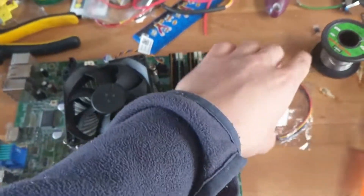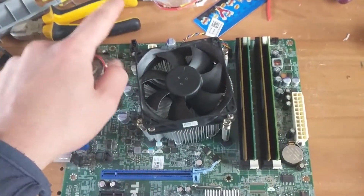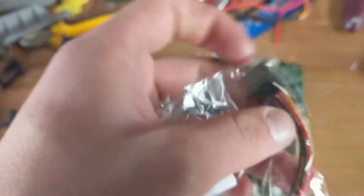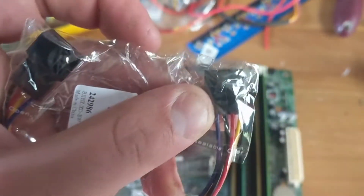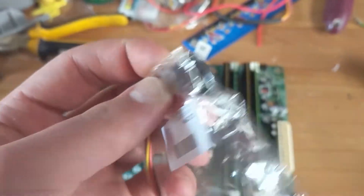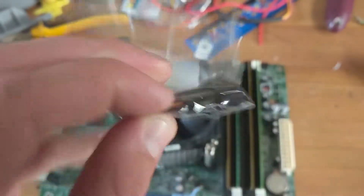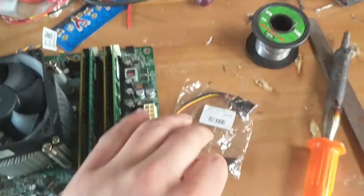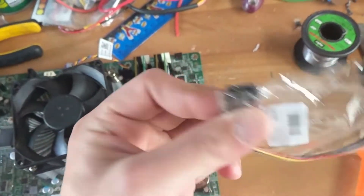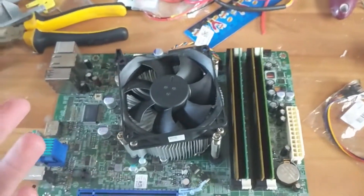Let's start with the easiest error to fix. I believe it is the hard drive error on the 990 or the system fan on the 790. What you need to do is buy a Dell proprietary plug — it's 5-pin, only using 4 pins to your standard 4-pin PWM fan. You plug the Dell end into it, plug in a system fan, and you've fixed your error.